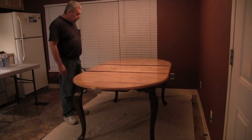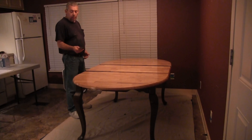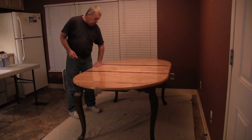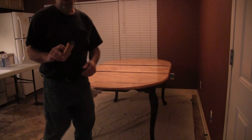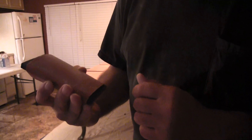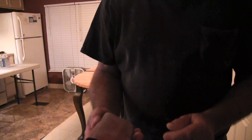It's been about four hours since I finished putting the second coat on. I grabbed my sandpaper and started to lightly sand across the top, but my sandpaper started to gum up a little bit — you can see those spots. When they gum up like that, it's just not dry enough to start cutting on yet. So just as soon as I stop seeing that, I can start cutting on it. If it doesn't clear up, I'll just sand it tomorrow — no big deal.